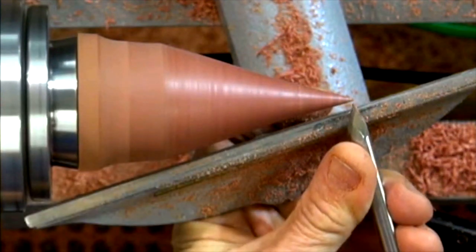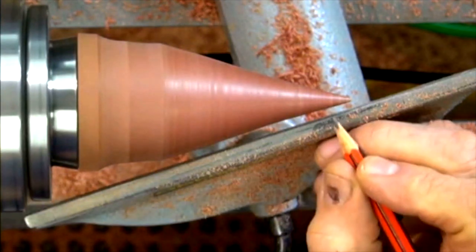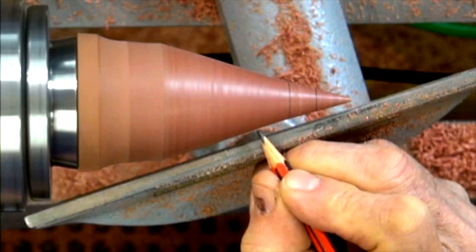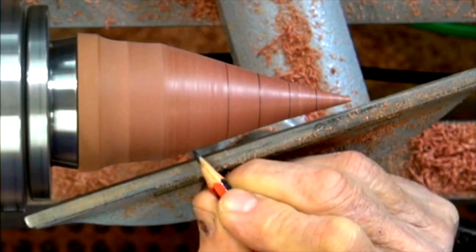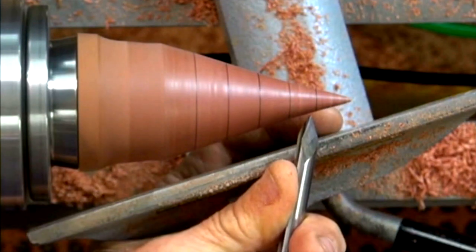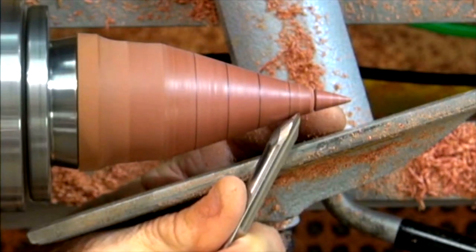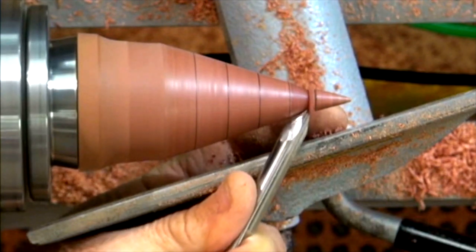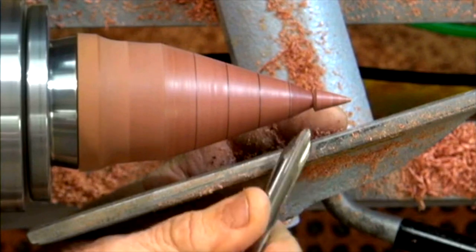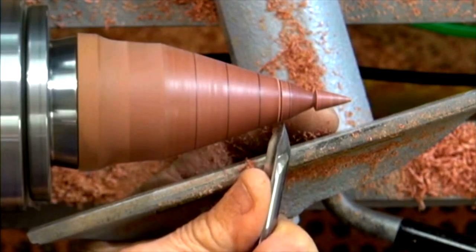But I will cut that little point off — a little bit sharp. So now to use the spindle gouge similarly to how you would use a skew — that would be to go in square, work my way up to the mark, and just cut back to the next mark. You can see the sort of finish you can get off a tool using a spindle gouge, and because it's got the swept back edges, there's no chance of catching the wing.